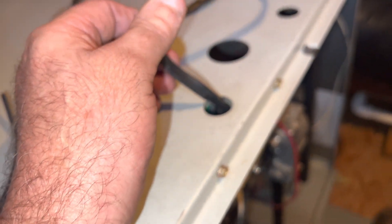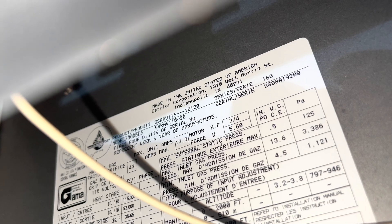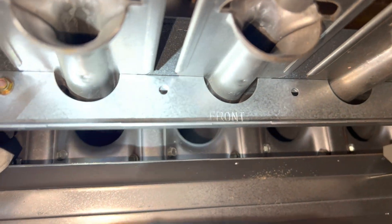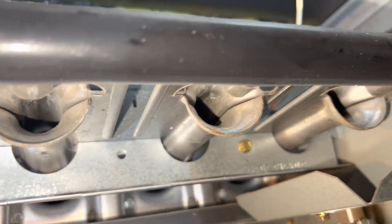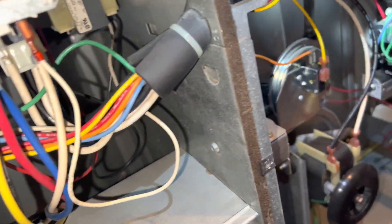I'm going to have a look in here. They had a power outage — I don't know if the power going on and off did it or something. But this doesn't look kosher either — it's all rotted away. There was a plastic bushing in there but it's all rotted away. I'm guessing this thing must be about 20 years old. Looking at the tag: 1998. So this thing's old. We don't use heat much in California — look at that heat exchanger, it looks brand new. Heat's never been used, I don't think. Let me open this up and see if we had a loose wire or something. There are all kinds of little bits of loose wire.